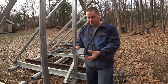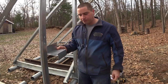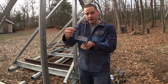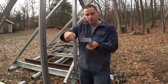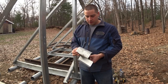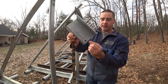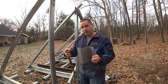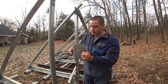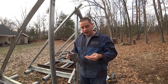So in setting up an experiment, at first I thought I would just take a piece of Z-channel and put it on the frame, screw it in place, and I'd step on it. But then I realized that if I put my force out here, it would wind up causing a bending, so I'd have a moment force — I'd have the downward force, which is the shear, but also the pull-out force as this tries to lever and pivot out from the wall. So to try to take care of that and make it only a shear force, I drilled a hole in the Z-channel. I'm going to screw this on and then use a hook, tie it up into a little loop, and put my foot in it. What that'll do is really cause the direction of the force to be just in shear and not in pull-out.